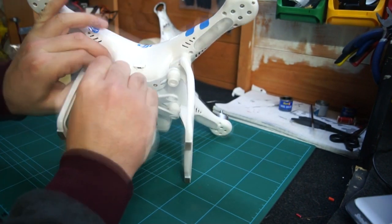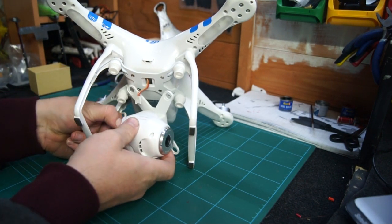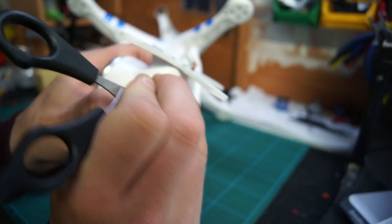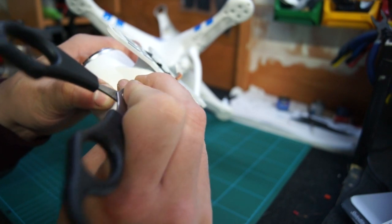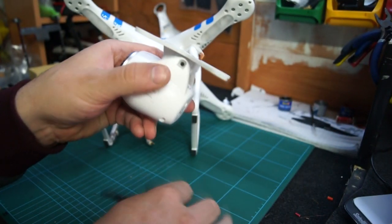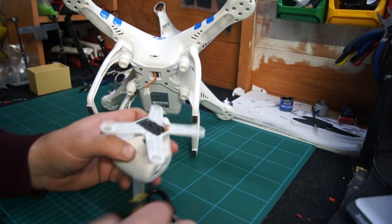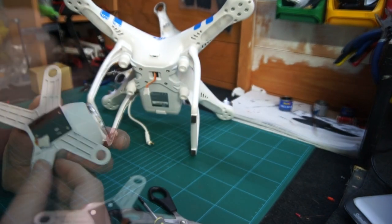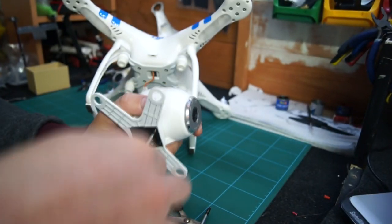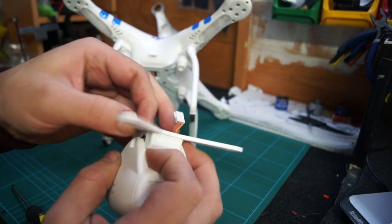Disconnect the camera from the rubber mounts. Then unplug the servo cable and the FC200 cable that is in the back. Now using a screwdriver or scissors, pull off the rubber cover that covers the screw hole on one of the ears. This screw goes right into the servo and holds the whole mechanism together, so we need to take this off. Then undo these silver screws that you see on top. This will help move the servo, then releasing the camera from the bracket. All of these steps can be reversed to put this back to normal.